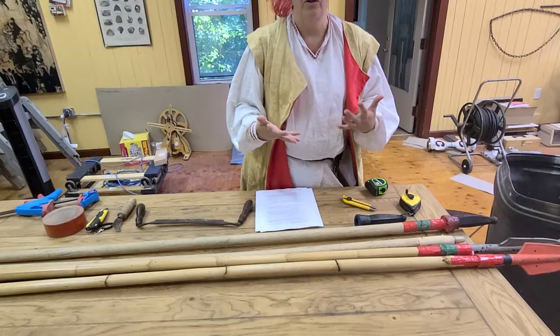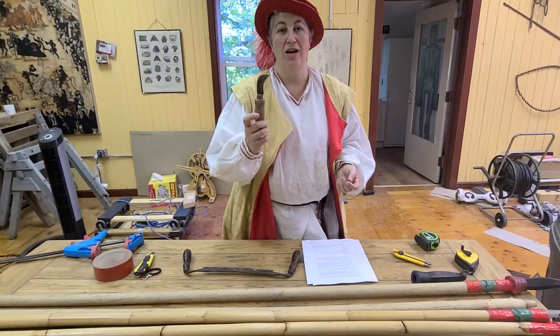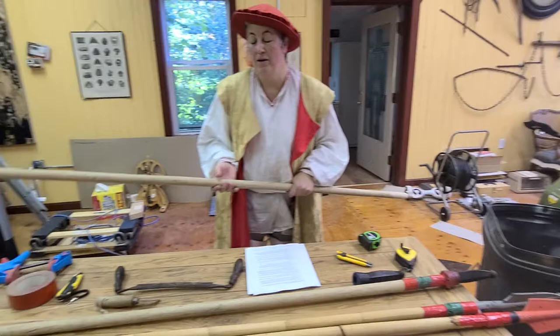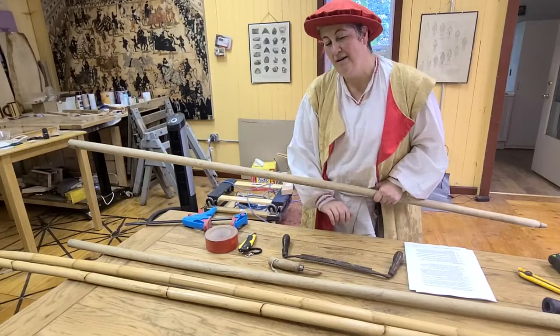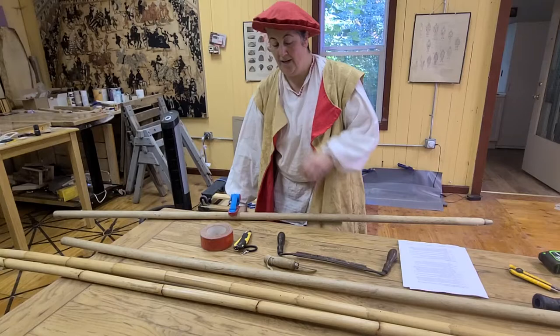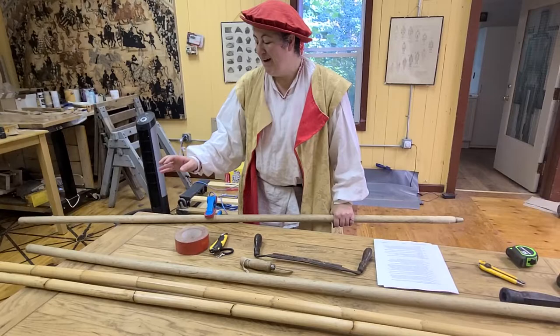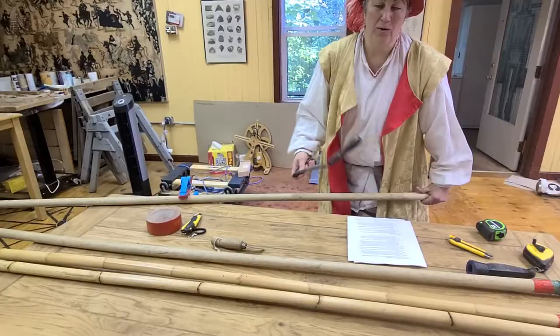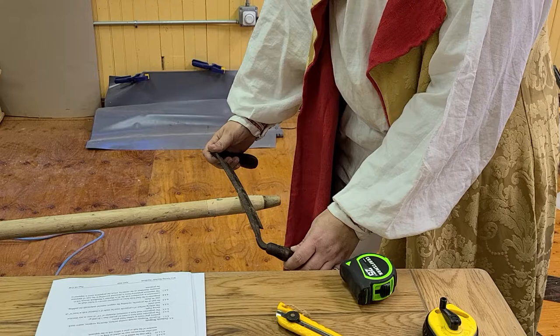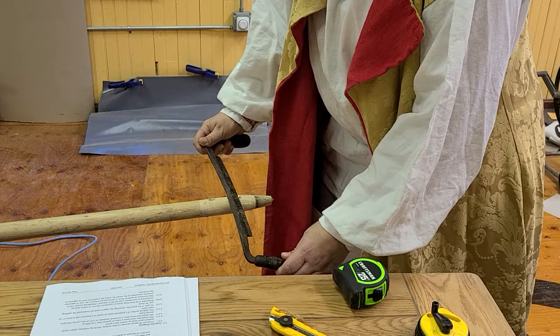If you're patient, you can also use a whittling knife — this type of knife, which I'll be honest I'm not entirely sure what it is, but I inherited two of them a long time ago and they're super useful. To use a draw knife or that type of knife, the best thing to do is to clamp your rattan to something rigid. At Gulf Wars I didn't have a clamp, so I had someone — actually a Kingdom Ranker Marshal of a Kingdom, but also a dear friend — sit on the end for me to provide the friction I needed in order to shape the head. Now that I've got that nice and secure — sure it's still a little wobbly, but it's not going to pull out and it's not going to be a danger to me — use the draw knife carefully, simply dig in and pull. It doesn't actually take very long; I probably did each of those two in about 20 minutes. The trick here is a sharp draw knife.